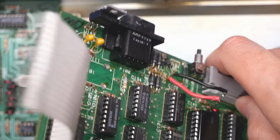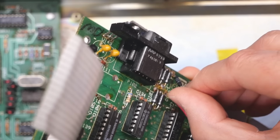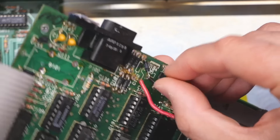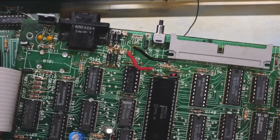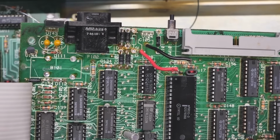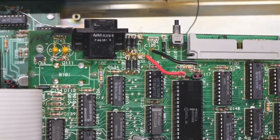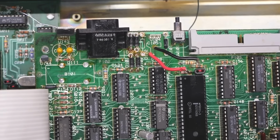Oh, you know what? That looks like a tantalum cap, certainly, doesn't it? Yep. I'm used to them being yellow color, but the cylindrical shape on there, yep, it's a 15 volt. I'm just gonna replace this with a different type of cap. You know what's funny? With that cap removed, doesn't it look like there's a little bit of a burn mark on the PCB as well? That was probably the smoke that got let go from this thing that was reported to me when it was plugged in the first time.